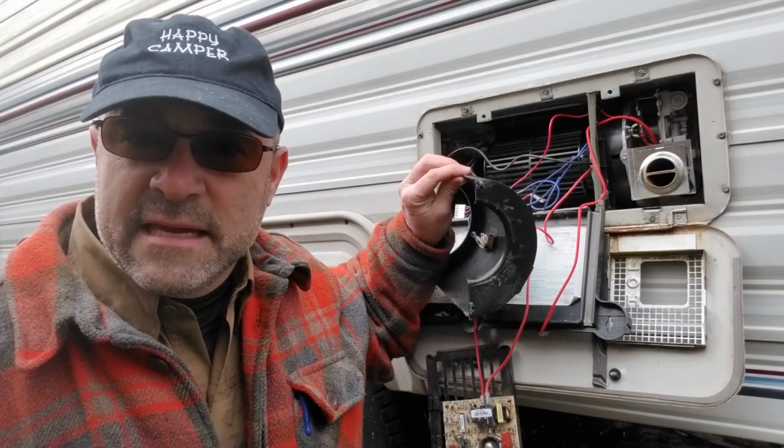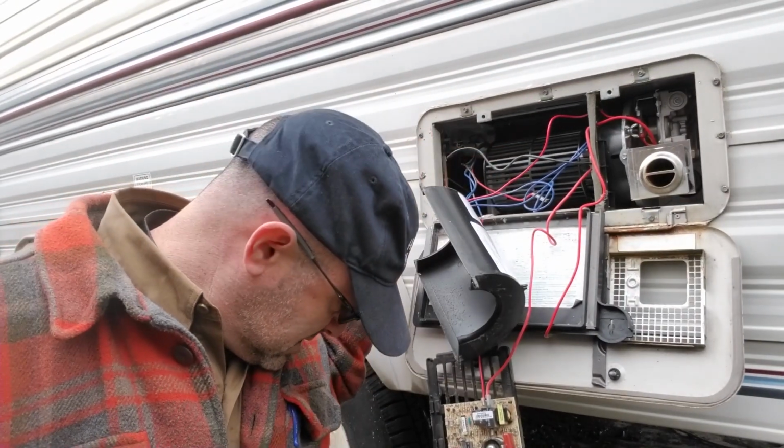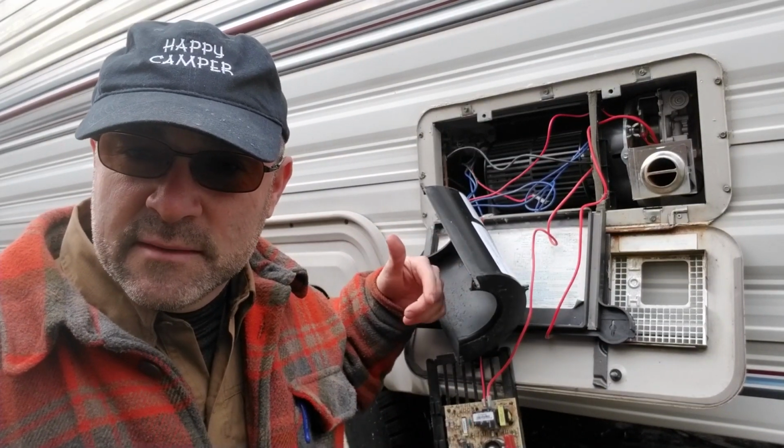The furnace did exactly what we would have asked it to do. There was a fault, and what it was is this blower housing broke free from inside, and things were falling. The wing nut just fell. Isn't that amazing that this furnace was smart enough to turn itself off? We could not support good airflow. We could not support combustion because the ears dry rotted off. The screws kind of fell off, allowing more air into this area. The sail switch was not able to be made. And the furnace is doing everything correctly. He's saying, hey, there's something wrong with me.